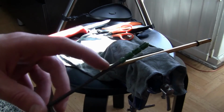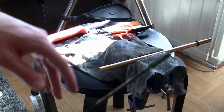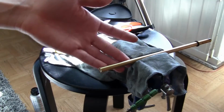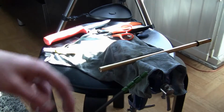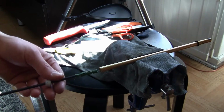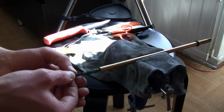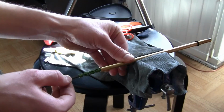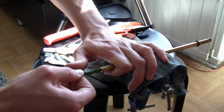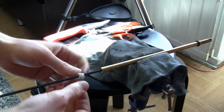Alright, so I glued this pre-embedded lap on my rod here, and I'm gonna show how this is done. And one thing to note, it's important that you clean the barrel really well first, to make sure that there isn't any contamination that would ruin your finishing here. So as simple as it is, you just install it in your barrel. It's sort of sticky. There we go.